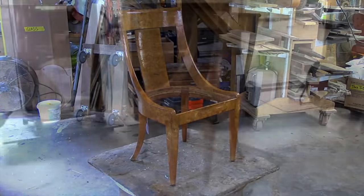Okay, I left quite a bit of stain on this new piece, trying to get it the same darkness. It doesn't need to have any finish on it, but I'm actually going to seal it with just one coat of a Van Dyke Brown aerosol, just to fix that stain so it doesn't rub off. Okay, I've let that aerosol lacquer dry. It's not really showing any build. Blends in pretty good. So now I will assemble it.